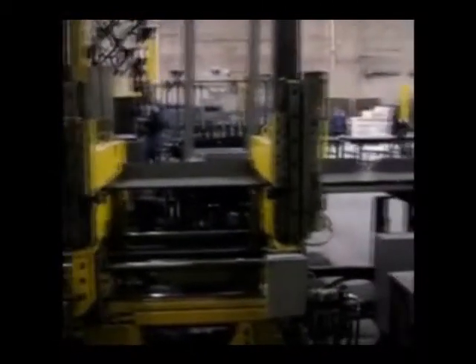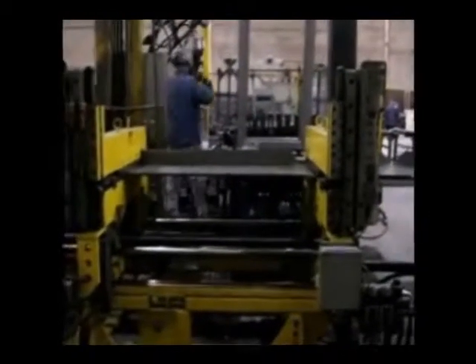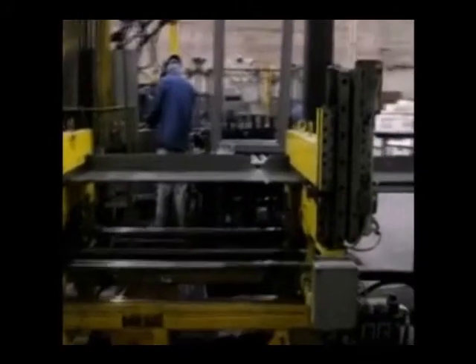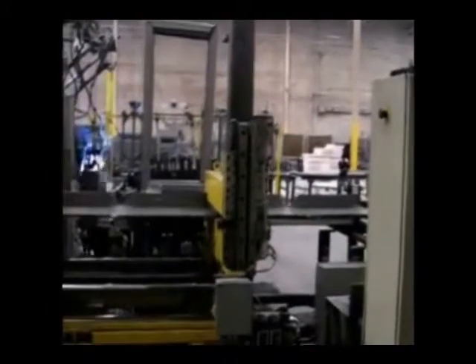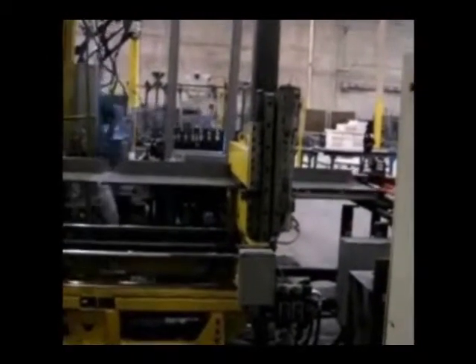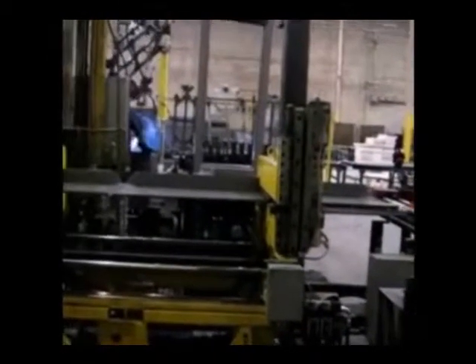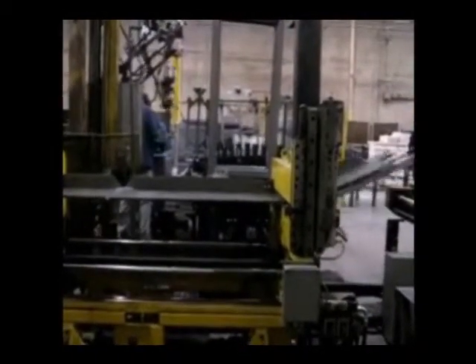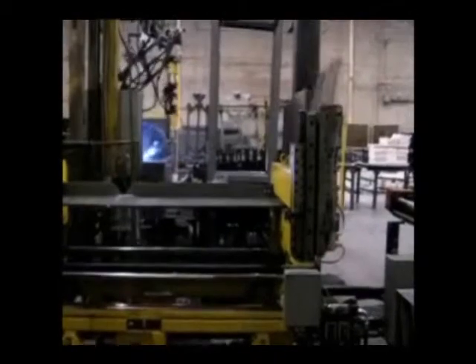The completed full wrapper safe cabinet housings are ejected from the tangent former onto a conveyor or staging area between the former and first weld station. When the welder removes a part from the staging area, it signals the system to manufacture another cabinet. A variety of cabinet sizes can be produced with the same coil strip stock without any setup, changeover, downtime, or scrap loss.